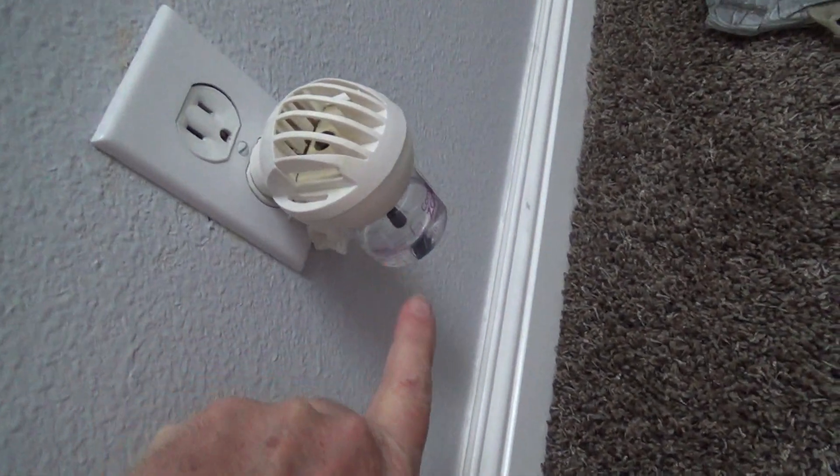Like for your blender, your toaster, your mixer — stuff that you have on your counter in the kitchen. Or your bathrooms: lots of times bathrooms will be on 20 amp circuits and then you're going to want 20 amp GFI outlets because you're running motors and stuff.